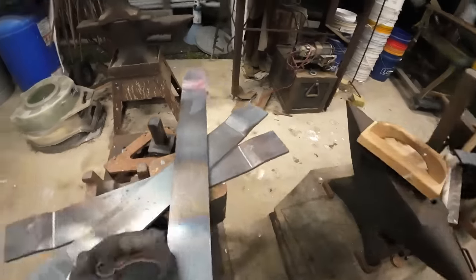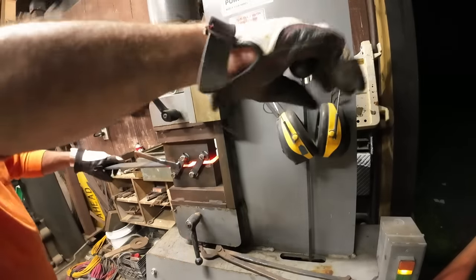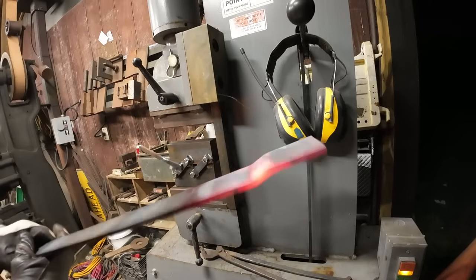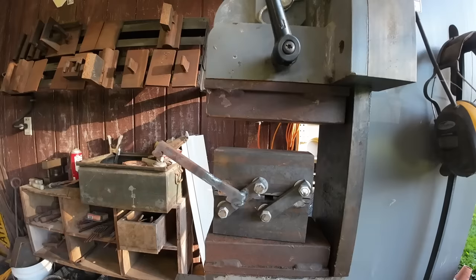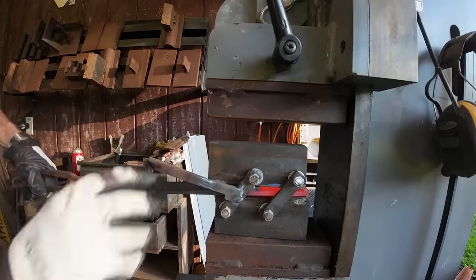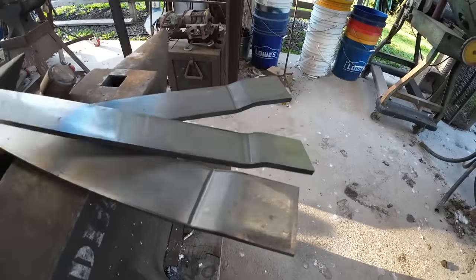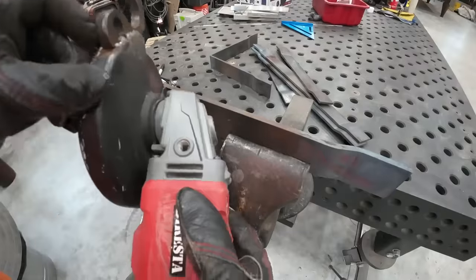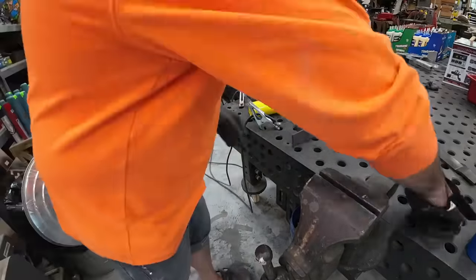Now I'm doing the steel accents. I made this little die that gives me an offset flange — that's one-by-two, one-quarter by two-inch thick cold-rolled steel. By putting it under the hydraulic press I'm able to get that little jog. It's a subtle thing, but my inspiration was a whiskey barrel band, the way they hug and take up the bump. I made my measured pieces — this is going to be the corner — you can see I've already done a couple sitting on the weld table.